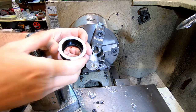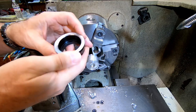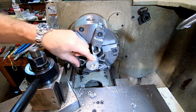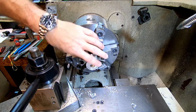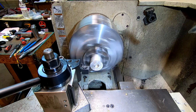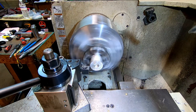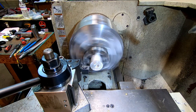Now that I've got this part modified - shortened 353 thousandths to make room for the lens to come back far enough - I'm going to move to this piece of metal and shape it into the actual adapter that the lens will latch to. I know it doesn't look like it's running true - that's because it's not - but it's irrelevant because we're going to re-true the whole thing. I've zeroed out my Z and the OD has to be cut to 1.810.